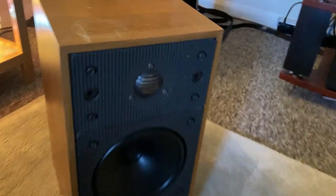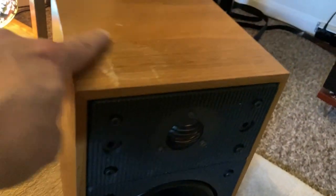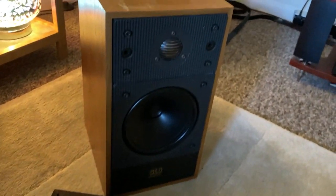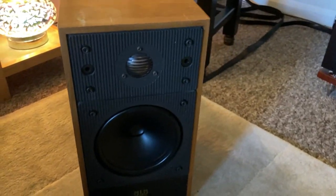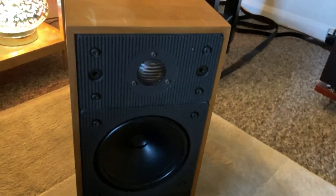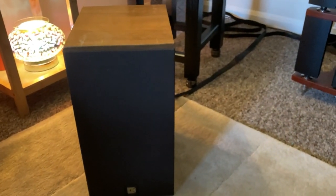And that one with a new HF unit. There's a little bit of discoloration on this cabinet, but it's considerably better than it was. All cleaned up, nice drive units. So this one now has a new crossover, a new tweeter, drive units cleaned up, and rehoused in new cabinets that were complete with their grills — which makes them look a little bit better.